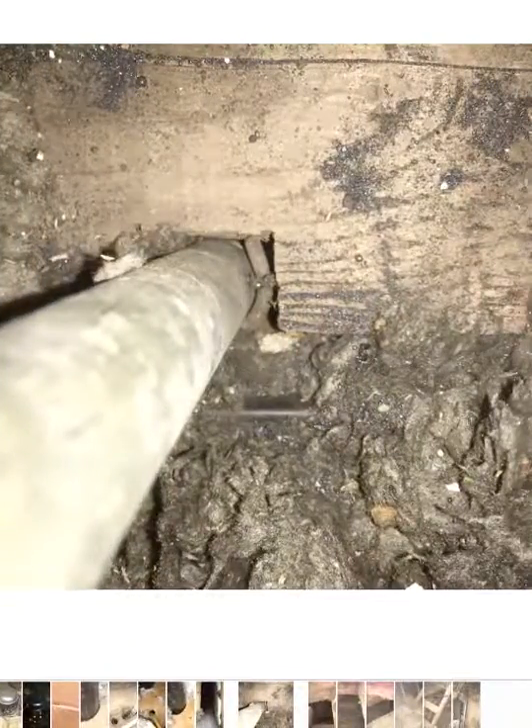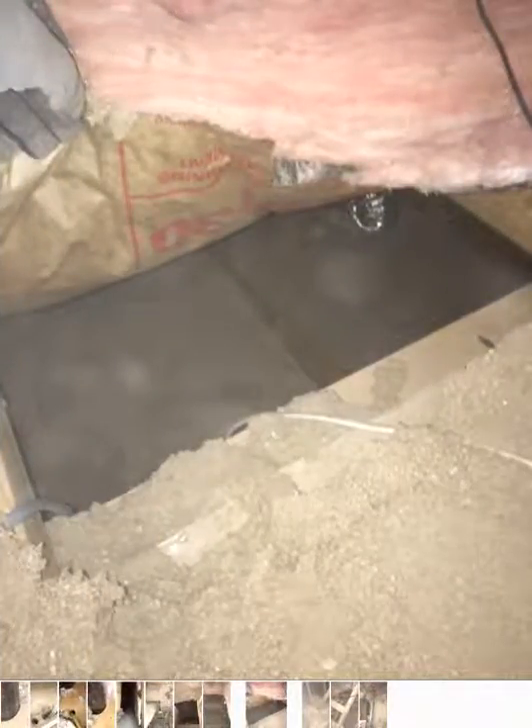There's another one. This is a pipe — this is an older home obviously. Here's a soffit that's been covered by batts. They've laid the batts across it to try and pretend like it's not there or something, but it's terrible. It's just a cave underneath there where this is all heat. There's a chase here — a void that drops down to the foundation. This is the inside of the home, that's a roof of some room somewhere. There's a knee wall. Here's a seam that hasn't been sealed either. This all needs to be addressed — these batts should all just come out and this needs to be capped with a foam board, sealed up, and then buried in insulation.